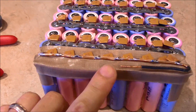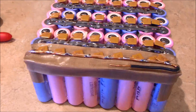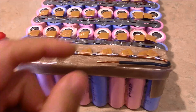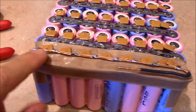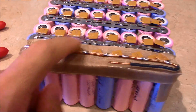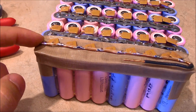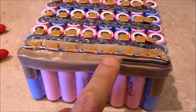So this is the end of the battery where the main positive is. I didn't have the fuses on before and wasn't really sure how I was going to do it. What I did is I found this wire here — I believe it's 14 gauge — hopefully it's thick enough for the end of the battery. I've got all the fuses basically attached to this wire. The balancing lead is going to attach over here, and the charging and controller wiring is going to attach right here.